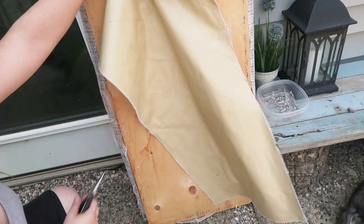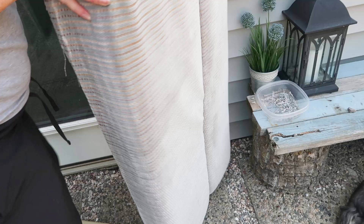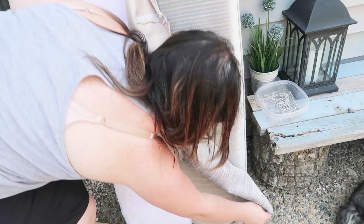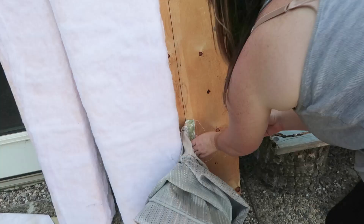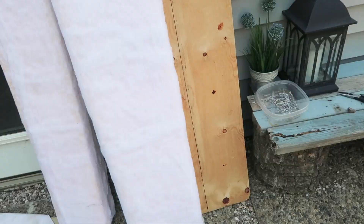This was kind of a long process so I just enjoyed it on our patio outside. Once the staples are pulled off the back cover, you can just remove that. Pull out any excess staples, and then you can just slide that front cover off. If it has a tuck like mine does, you're going to have to remove both pieces of foam inside. I just found where the middle of the cover was attached to the plywood and pulled some more staples with my needle-nosed pliers to get the rest of that fabric off, then just throw that old fabric away.